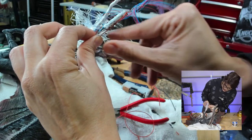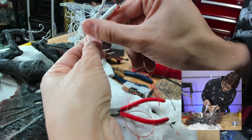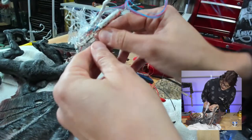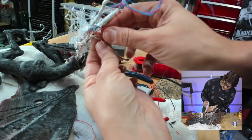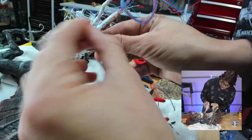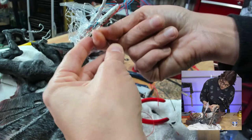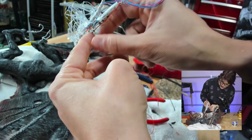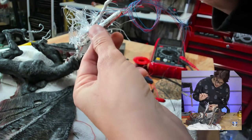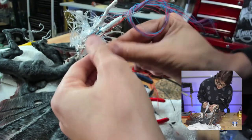All right, so I'm going to start wrapping, as I do, with the insulation. And this guy too. Let's start wrapping both of these, insulation and all, until they make contact. Not the prettiest. If it were any thicker wire, then yeah, we would be tapping and cutting and only dealing with the one wire, but I just need to make sure that this will tap in. So I may have to tap this one in first. Never mind. Abort. Let me tap that one in first real quick.